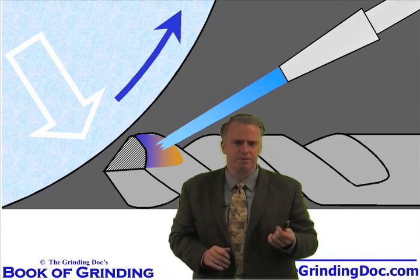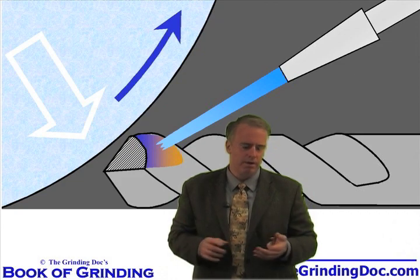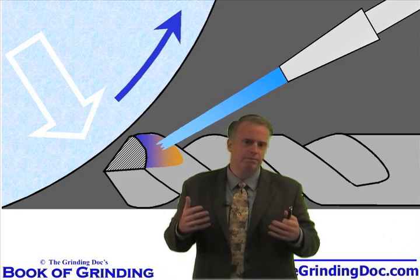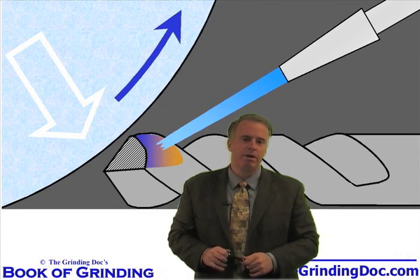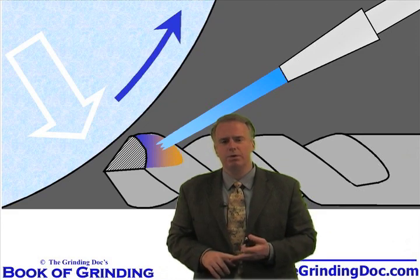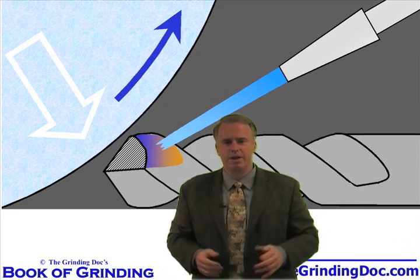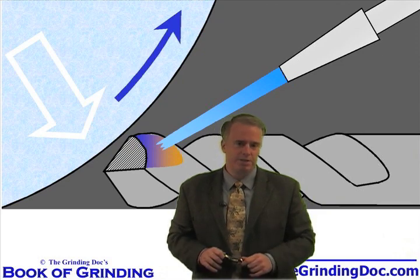It's the same with work pieces. If you're grinding ferrous materials, the temperature gets high and the iron in the steel reaches out, finds oxygen in the atmosphere, and combines to form iron oxides — brown, yellow, and blue marks. And you can actually get an idea of the temperature that was reached based on what colors you have.